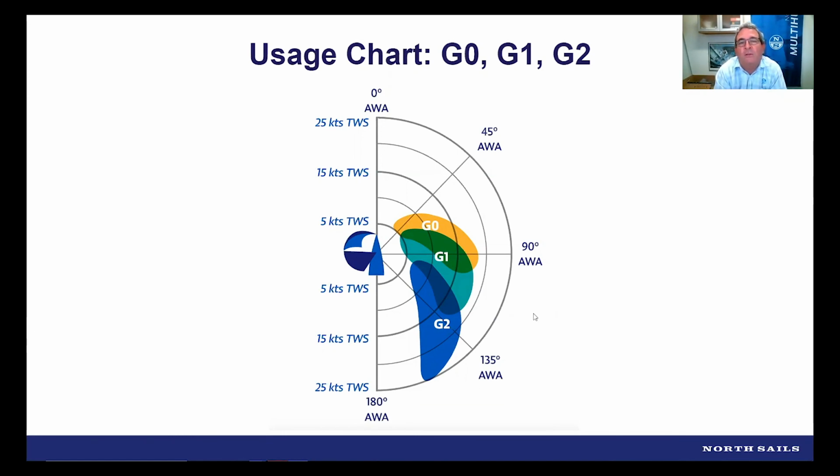The biggest advantage that a symmetrical sail has over an asymmetrical is jibing. Jibing's a snap. You use one line, you pull in the other. Jibing an asymmetrical just requires dousing and then releading the tack and the sheet, usually, unless you're using two sheets. Symmetrical's real easy. So if you know that it's coming home from the Caribbean at the deeper angles or sailing across the Pacific, a symmetrical sail absolutely has a use on big cruising cats. It's a little more specific, but a great tool.